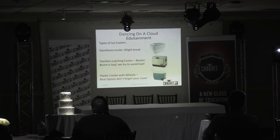Possibly. But there is moisture in there, and if you start getting moisture, it's gonna create a cloud of itself inside, and it could create ice, and ice could block that, okay? Just know that, okay? But that's a good question, it's a good question. Or if you are gonna use something similar to that, install a pressure relief valve on top, so it always has a way to do it, okay?